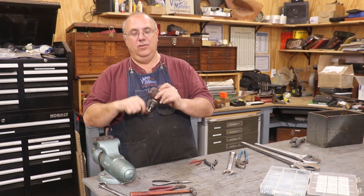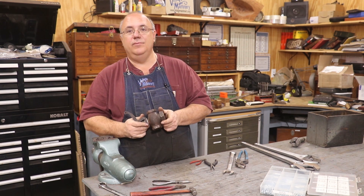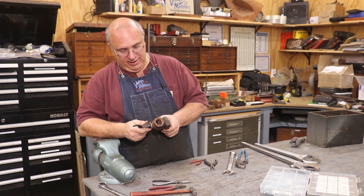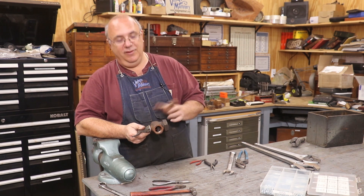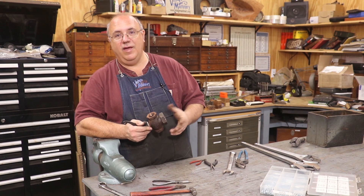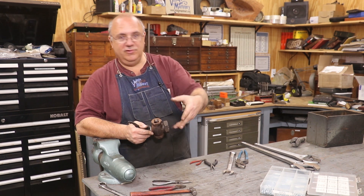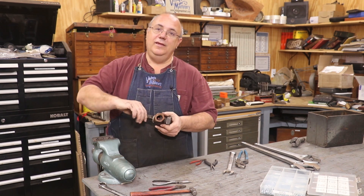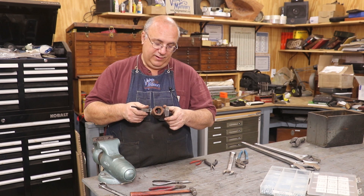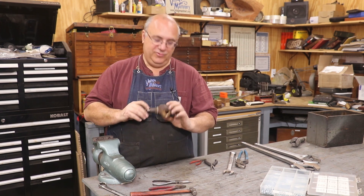One little job done - a quick job in the shop today, but I thought you guys might enjoy seeing that. We get to do a lot of this kind of work at the museum around their steam equipment, and this kind of stuff just comes up all the time. We saved another valve. You can still purchase new ones, but they're expensive. I've fixed quite a few valves out there over the years - it's usually the seats wearing that's the problem. You go in and use a kit like this or a variation like we did today, cut some new seats, and these valves are good to go for another long period of time. Some of these older valves are a lot better than the newer ones you can get today.